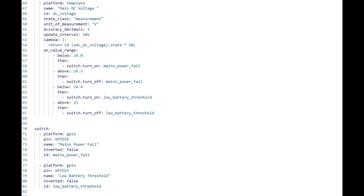I needed code to switch the trigger pins. The IO pins on the ESP are connected to IO pins on the Duet, so if an IO pin goes high the Duet board will see it and take the appropriate trigger. I didn't want to use Home Assistant to do the trigger because that relies on Wi-Fi communication, and if mains fails — which is what I'm detecting — I won't have Wi-Fi because my mesh network will go down. So the automation logic had to happen on the ESP32 itself.